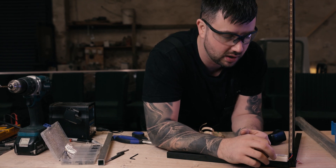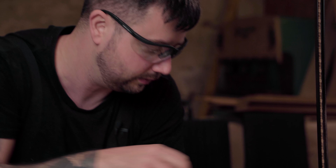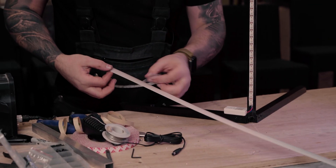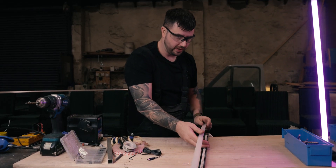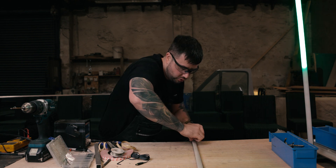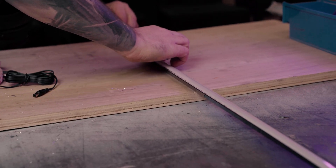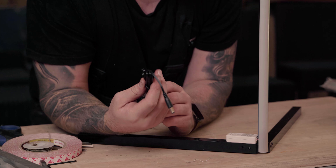The controller is not too invasive — you can paint it black if you want, but just remember it has a QR code on there. You need to scan that code with your phone to get the app to control these lights. All we need to do now is apply the diffuser to the front, plug it in, and the rest is on your smartphone. The diffuser has plastic film on it — peel that off, it's just to protect from scratches. It clips into the profile and diffuses the light; without it you'd see each individual pixel. It's a bit of a nightmare to get in at the start, but once started, hold your thumbs and run them up and it'll push right in. Take your five-volt power pack, plug it into a power source, and we're ready to program.